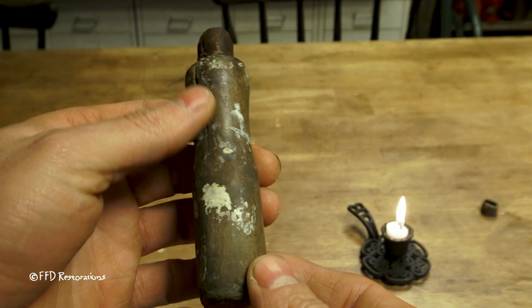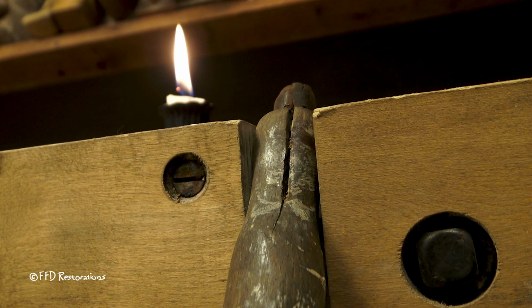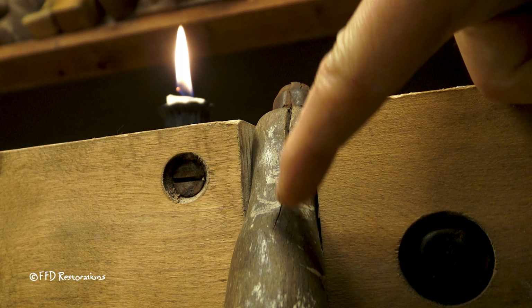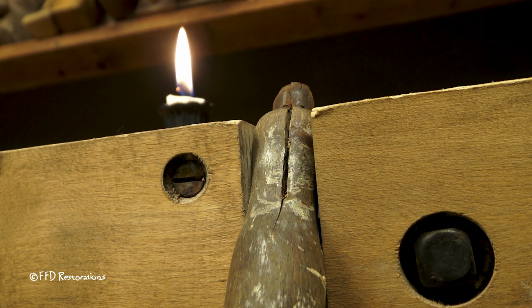First, I'm gonna sand down and remove this surface layer. That is actually not so bad, but still it's quite a big gap. So I will use the simplest method, just sawdust and wood glue to fill this gap and leave it overnight.